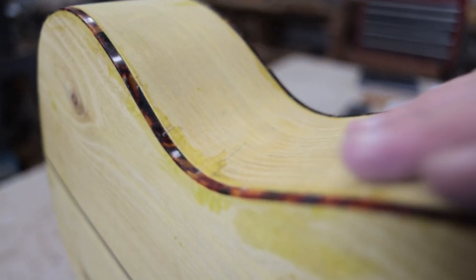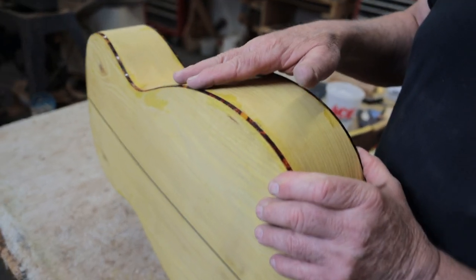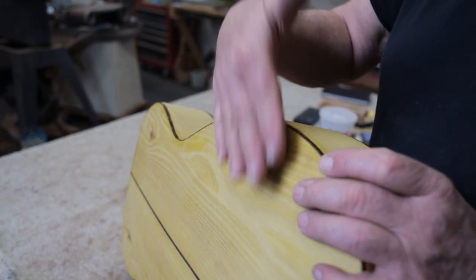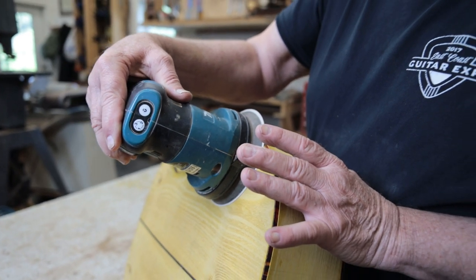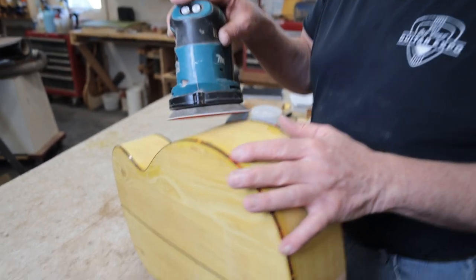You're working on the wood and not — well, you don't want to be cutting down to the binding. We want to keep this flat for now. If we want to put a rounded edge on, we can — we will do that later. Also when you're sanding the back and the top, the wood is a little proud there too. So what you want to do is basically be flat all the time. You don't want to round it until you actually want to round it. Otherwise you're going to end up taking too much off. What grit sandpaper are we using? This is 100 to start with, because there's so much material — there's wood, there's glue, there's lots. Nothing to it but to do it.